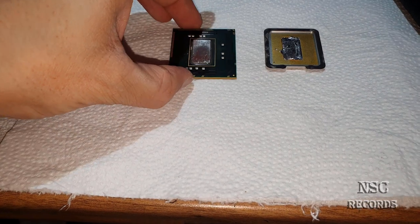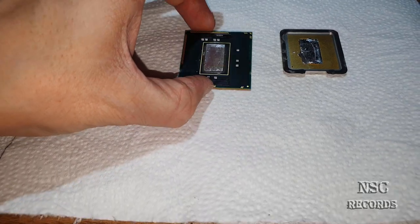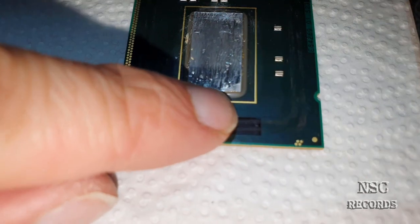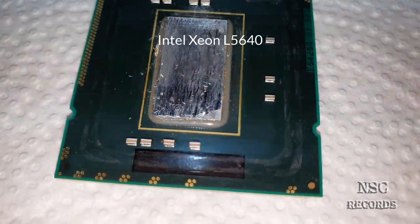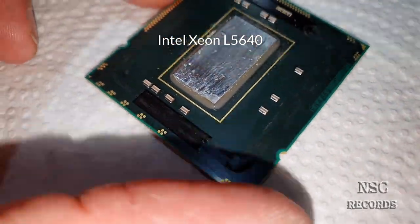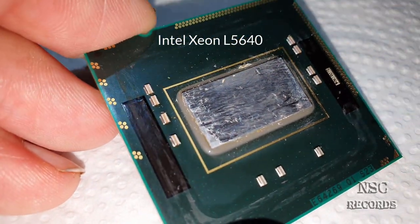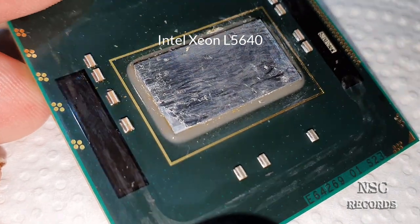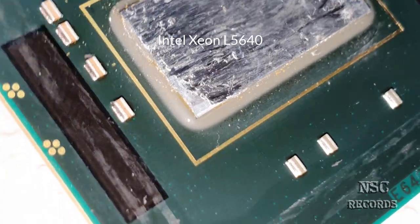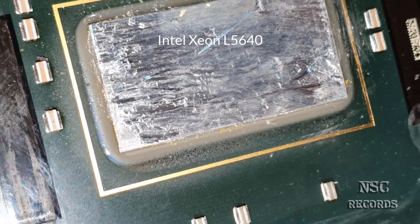The other thing is I have just opened this one here fresh. I have also cleaned the silicone, like you can see already, but this doesn't matter. The thing that I want to show you is over here. Look at this place. There you can see it was not really soldered. All the rest was okay, but here you can really see that. Let me make it a little bit sharper and focus that, and zoom. So here you can see on this small edge, there was not a great contact.